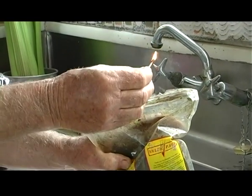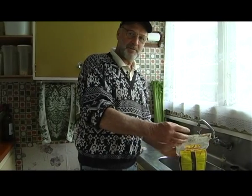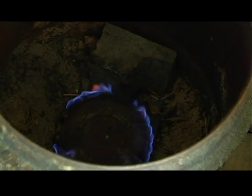That shows you about biogas burning — it's got a slower flame speed, so it just doesn't go 'boof' like it does in the movies. It burns fairly slow, you can see it coming. When I used to light the gas in the drum just to burn it off, I held it about two feet above the burner and it'd burn in the air — you'd just see this flame flickering in the air as it ran its way down onto the burner.